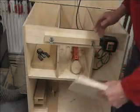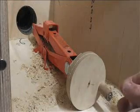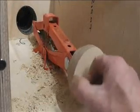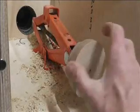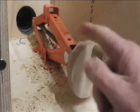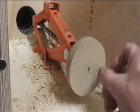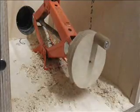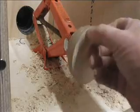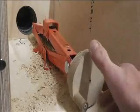If we just take the hatch off again and zoom in a little bit, you can see what I'm talking about — it's a little scissor jack which I've fitted in down there. It's just basically screwed to that bottom there. I've used the same router trammel on my router to create this little round disc here with a little handle on it. I've just epoxied it onto the end of the router where the big handle usually goes, and it does provide quite an efficient lift — possibly not quite as sensitive as I'd like, but it's okay.